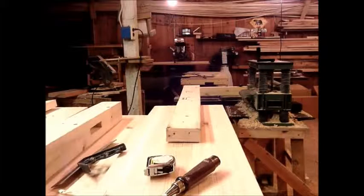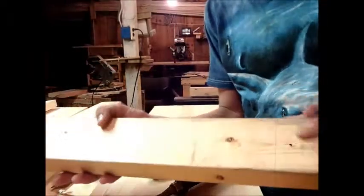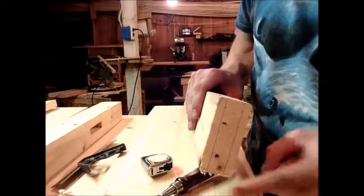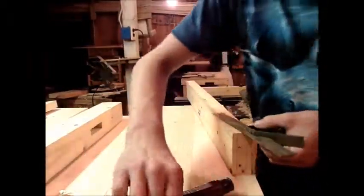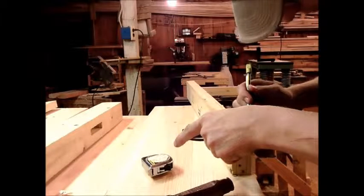Let me move this out of the way. I've got it set up — I'm going to try and cut it with the camera on the table. So what I've done: I've gone around and marked in. My legs ended up three by three, and I've marked three and a quarter because I want this rounded over a bit. I've marked it all the way around both sides. Then I centered my chisel to get the exact width, put two marks. We're going to be cutting down these marks to that mark.